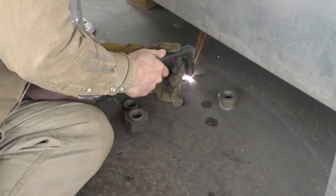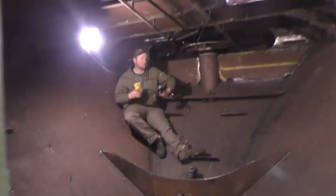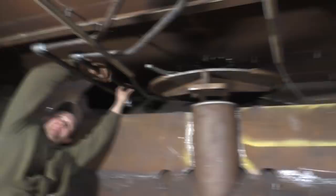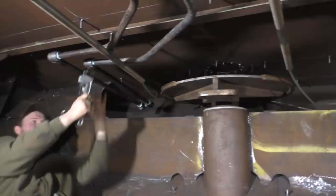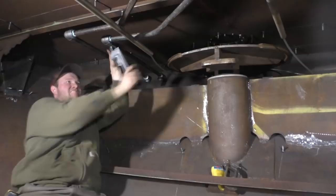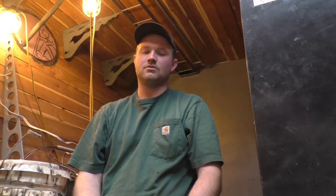That's much better than the grinder. Put a little piece of sheet metal up there to keep it out of the pipe, and fire blanket on the floor. It's going to fit - I'll probably have to move it one way or the other, things go on the floor tiles later. That finishes the aft cabin. We're going to run hoses off the ends of those pipes to cylinders that drive the rudder quadrant - connected to the post that's connected to the rudder. We also need through holes in the back deck to go up to the winch that runs the davits.